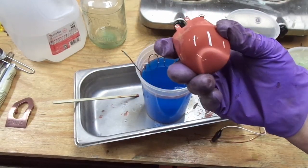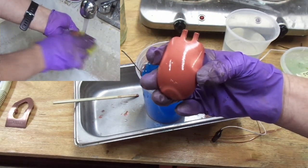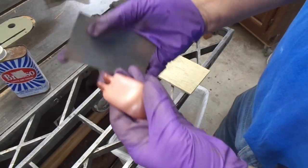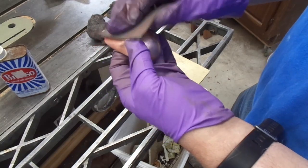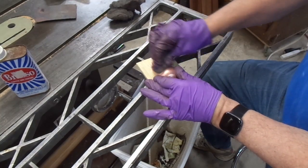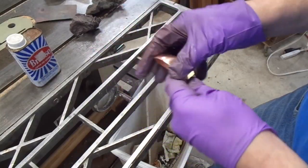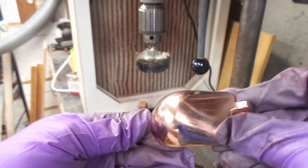Next I bring it over to the sink and give it a good scrubbing with a scrubber sponge and soapy water to start getting a shine on this. The plating marks from the cathode are nearly gone. You can see it's got a bit of a scratchy, matte finish shine on it. Here I have some 600 grit sandpaper that I lightly sand it with, then some fine steel wool, then extra fine steel wool, then copper polish — that's very old, but it seems to work.